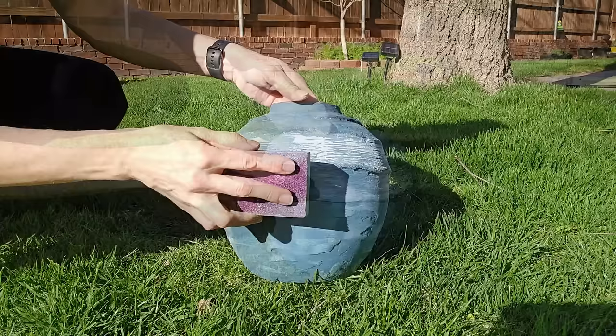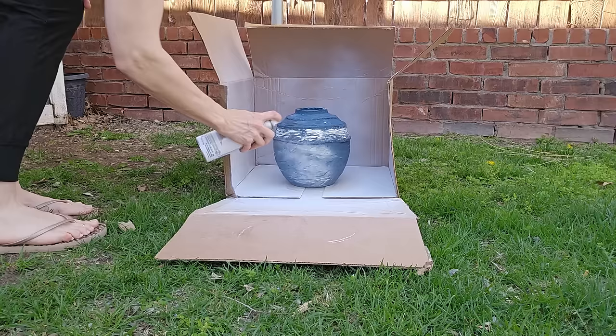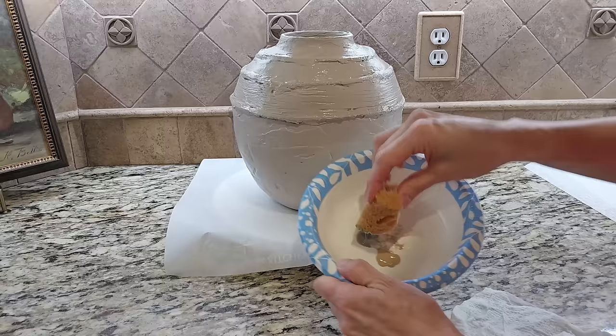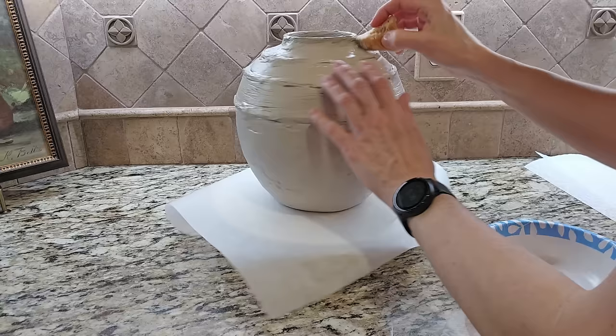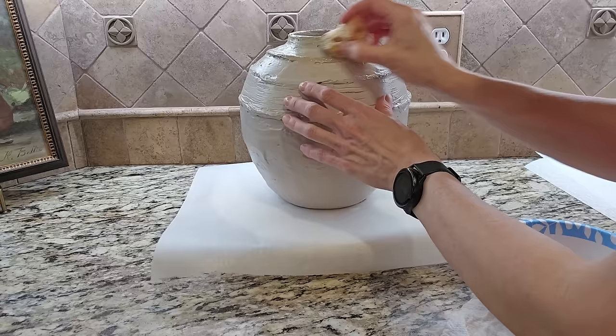Once I've knocked back the ridges and roughed up that paint, I'm going to use this Rust-Oleum satin finish spray paint as a base — it was a bit too shiny, but that's okay because we're going to do a painting technique on top. I'm using four colors: gray, light cream, bleached sand, and fawn. I have a wet sea sponge that I've squeezed all of the water out of so it's just barely damp, and I'm going to pounce it in all of the colors together. I've shared this technique before — it is foolproof. You can't mess it up. You can add more paint or take paint away. This is a very forgiving and easy painting technique, so just keep pouncing.